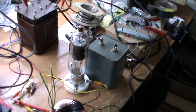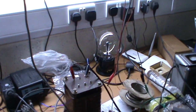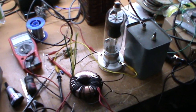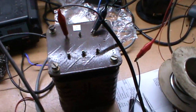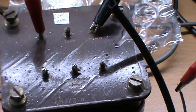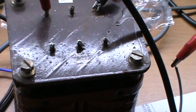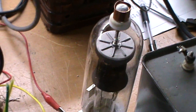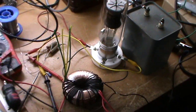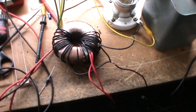In order to test these, I've actually got this thing rigged up to a normal bench power supply, which I'll just turn on. So I've got it rigged up to the bench power supply and we'll test it to see if we can get it to glow nice and purple. I previously was testing on this big chunky high voltage transformer in a standard half-wave rectifier configuration — this is actually a 600-0-600 volt transformer. What I've discovered with these is that the voltage, the high voltage, is not actually that critical for getting them to light up. They are dependent on the current, and it's the current that gets these things to glow quite nicely. So before we can rig it up we first need to provide a heater source, and what I've done here is use a standard 50 volt amp toroidal transformer.